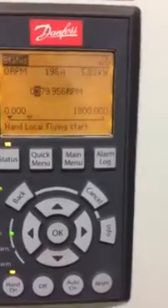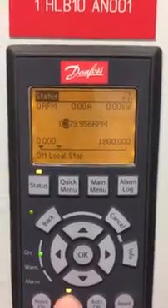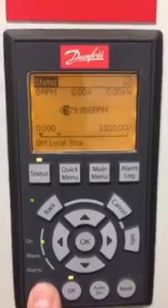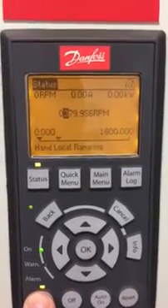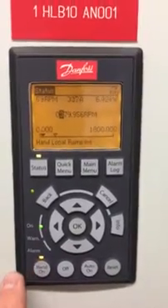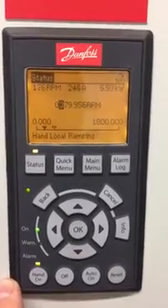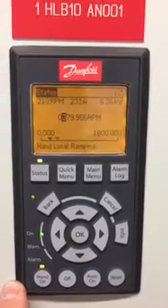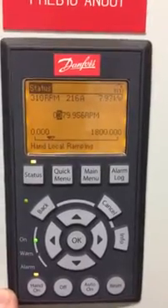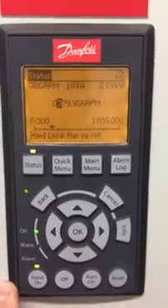But now if I press the off button again just to stop that sequence — I'm pretty sure now that the motor has stopped. So let's just try starting it again in hand. Obviously there's probably a little bit of rotation there, went briefly into current limit, but as you can see it's ramping up again as normal. And that's the problem: when it's actually trying to capture a rotating motor, it doesn't do it. It tries twice and on the third attempt it just basically sticks.